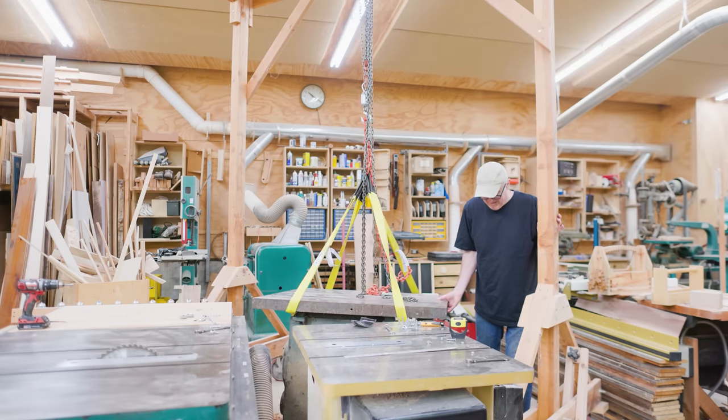For this saw I just had to make oak pads — I think I got the height right on the first try this time. It's more a matter of getting it in the right location so the T-tracks line up with the two table saws. They don't have to be perfect; I've found I don't really go from one T-track to the other since nothing is that long. The angle iron was hitting the wall, preventing the saw from reaching the right location, so I had to take the angle off to get it mostly into place.